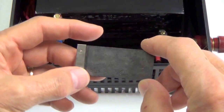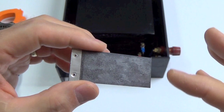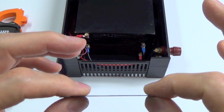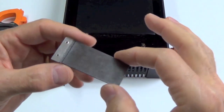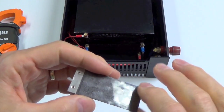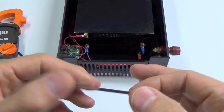Here's one of the prototypes. This is a graphite polymer cell — this is the graphite polymer plate on this side. The active area is 1 inch by 2 inches, and the thickness in millimeters is 0.4 millimeters, so it's very, very thin. On the opposite side is the graphite alloy, and this is just the contact terminal for the graphite polymer side. It's super flexible — this thing can be formed to just about any shape. It's very, very flexible.